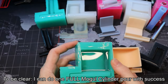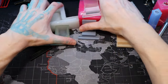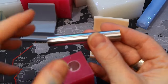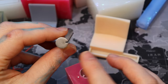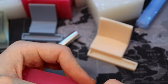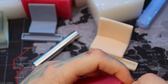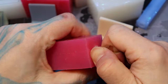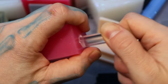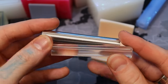This is the biggest I can go with one single pour of craft resin without messing up my molds or my models. You can also do stuff like followers — I have a follower here from the Huck set, it's a euro follower with a pinning shoe hole. You just cast that with your silicone — you can do that straight with 15a because it doesn't release gases. When pulling these out, you want to do a wiggle rather than pull it straight out, because it can tear the silicone. Small little wiggles back and forth — there we go, a perfect clear euro follower.